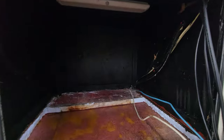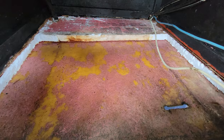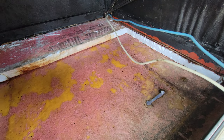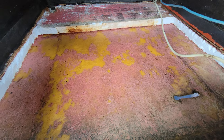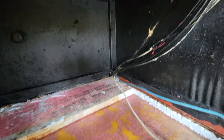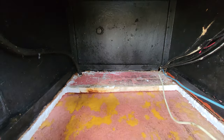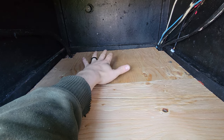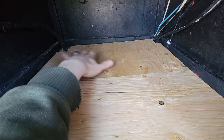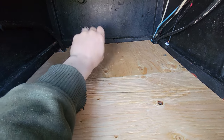Before going further in the battery compartment, I discovered some rotten wood on the bottom. I've completely pulled it all out and I'm going to replace it with new wood, coat it in resin, and seal it. My electrical panel will go up in the corner, all the new wiring will go on that wall, and the battery will sit on a new battery tray screwed to the plywood. I'll epoxy everything to make it waterproof and seal the whole thing so it remains watertight.